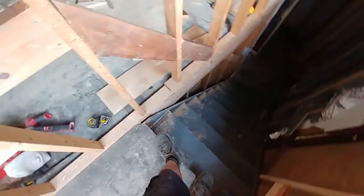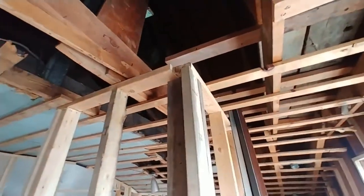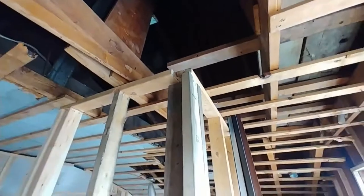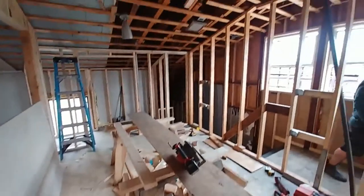So we moved this wall over. We had to saw it loose and slide it over to actually be flush with this framing. And now it can be drywalled as one homogeneous wall. And this one had to be rasped around here. This is the difference between being flush as it was before and where it needs to be in reality. So now we want to maybe talk about adding 1/2 inch of plywood on this floor, which would have been a nice place to start before any kind of framing. So it's really shaping up.